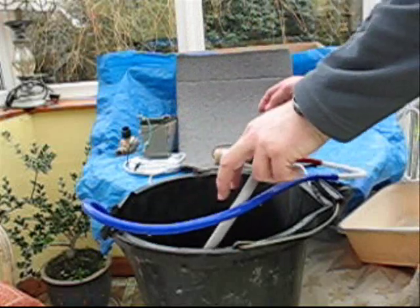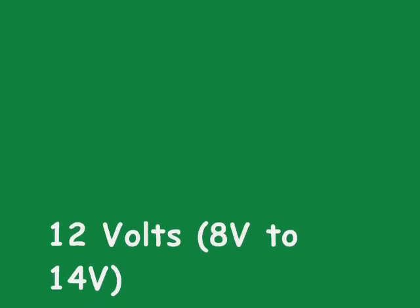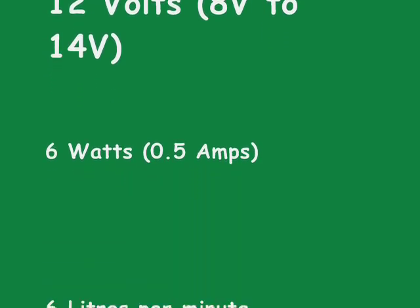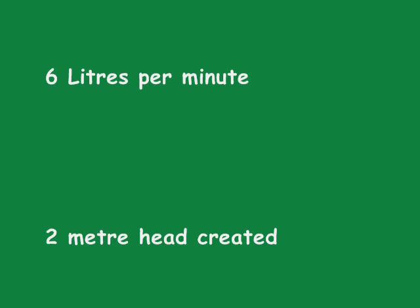This is a remarkably compact and effective pump, capable of pumping constantly and with a design life in excess of 30,000 hours of use. It has a ceramic axis, is made of food grade plastic, and withstands operating temperatures in excess of 100 degrees Celsius. It is not affected by glycol antifreeze. At under 30 pounds, this pump offers unique functionality and value.